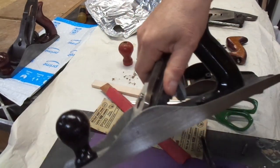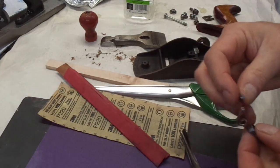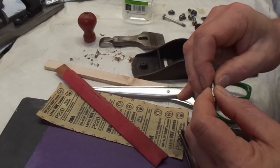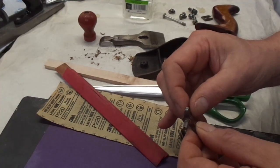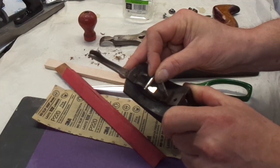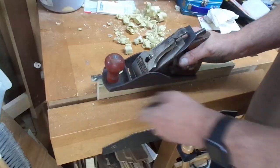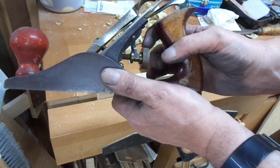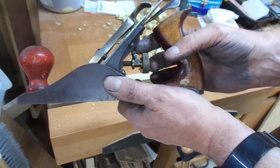Like I showed in the videos on this Miller's Falls hand plane, the technique I'm going to use is to take up slop between the pin and the hole in the yoke. Take a piece of aluminum — this is from a serving tray — and wrap it around the pin, forming sort of a bushing. When you slide that in it's a much tighter fit. It can be a little tricky but I've done it before. There's the yoke with the aluminum bushing in there. Just to give you an idea — when it's backed out, look at how many turns I have to make before it starts to push the iron back down. If I didn't have that aluminum bushing in there it would be even worse.